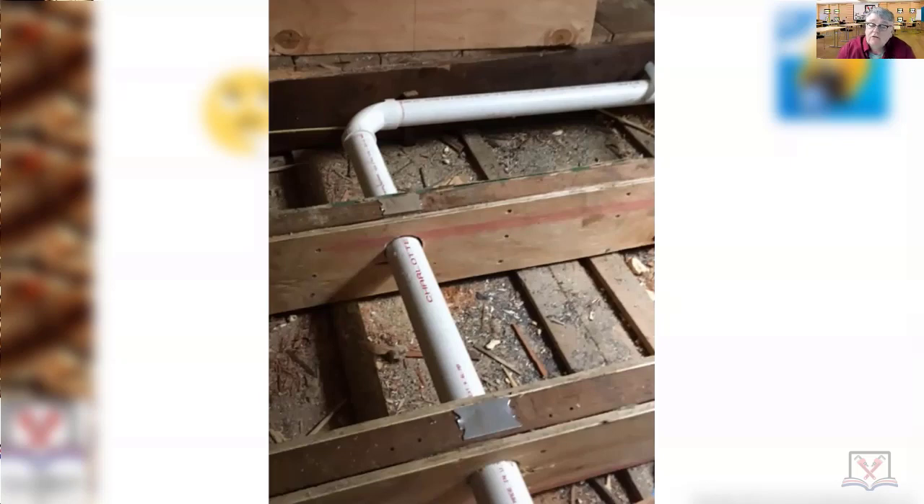It's also about things you see up in here, because the pipe is really close. Even though that's two inches — you can't tell that's two inches — you have two inches above and two inches below. But that pipe penetration exceeded one-third the depth of the member.